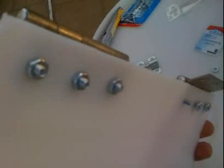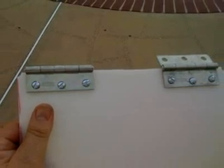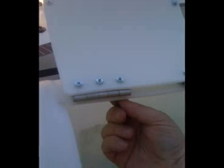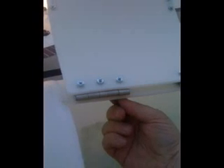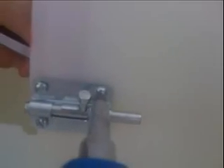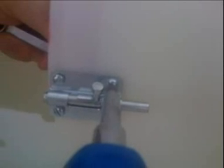Next, drill the remaining marked holes with your smaller drill bit and loosely attach your hardware to the panel and to the barrel. You'll tighten everything in a minute after you ensure it all fits together. Close your barrel up, making sure everything fits appropriately, and if it does, finish tightening down your hardware.